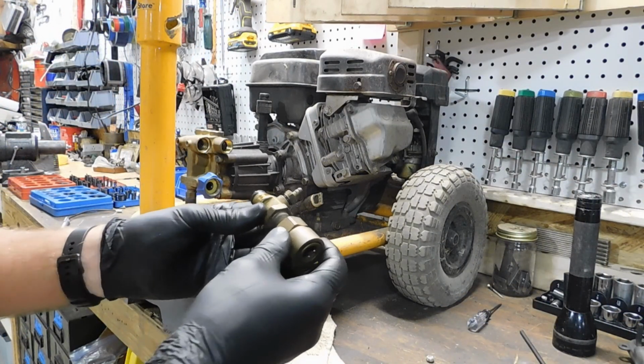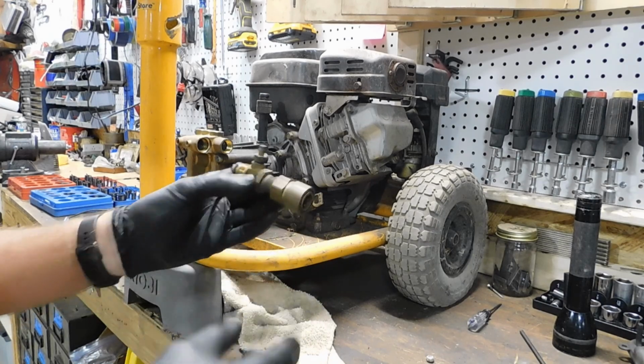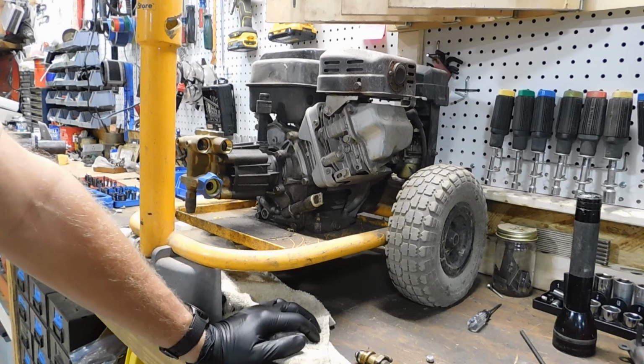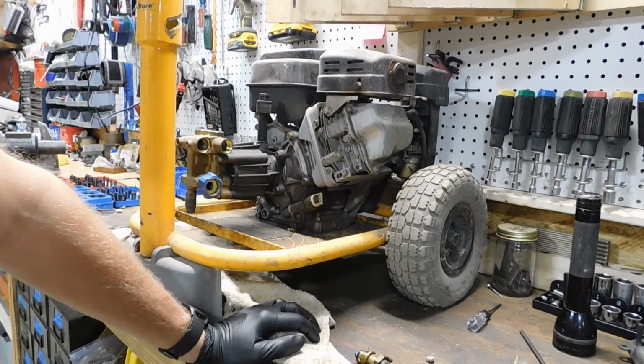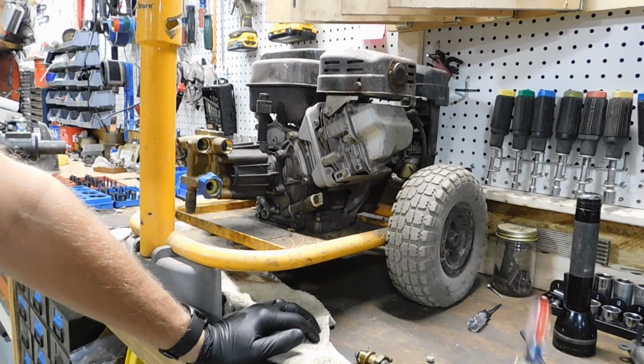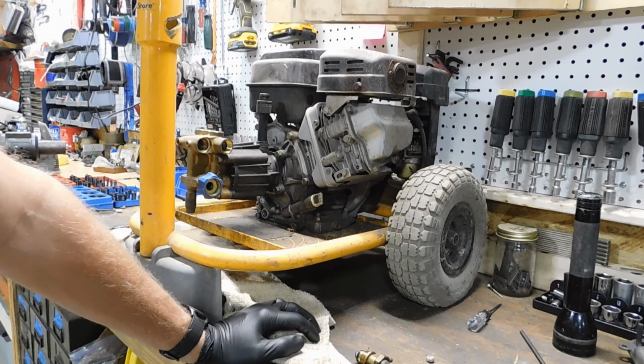All right, welcome back. I had to do a little YouTubing myself. And as usual, my predicament is always the oddball. Almost all YouTube videos covering pressure washers are covering the loss of pressure situation, and obviously, as the demo showed, I have no loss of pressure. I have no pressure drop or relief when you let go of the trigger. And I did find a quick blurb, could barely hear it in the background, explaining how these unloader valves work.